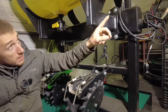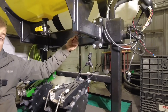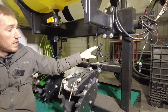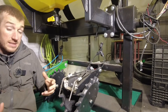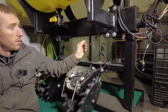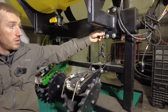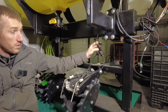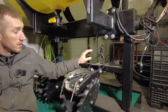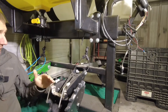Right here would be our single line coming out of our red ball, right up there. We come out the top of the red ball and come back to the row with a single line. Now we have to find a way to get that line split in two. They make all these Y's, and they do work, but we need to get it split and also orificed. We never like orificing before the split — like putting an orifice in and then just doing a Y.